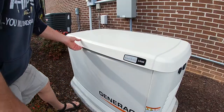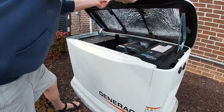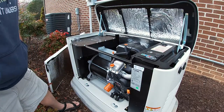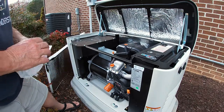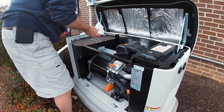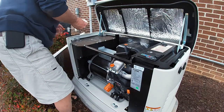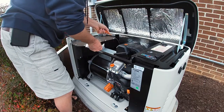Dad's is a 24kw Guardian. To get into this one, it's really nice and easy the way it's done. The top just lifts up like so, and the front just lifts up and out — gives full access to this. All of the oil things are marked in orange, which really makes it nice. I don't want to say idiot proof, but it makes it easy. So let's pull this dipstick out. The oil is so clean you can't hardly see it, but it is right up to the full mark. So we are good to go there.